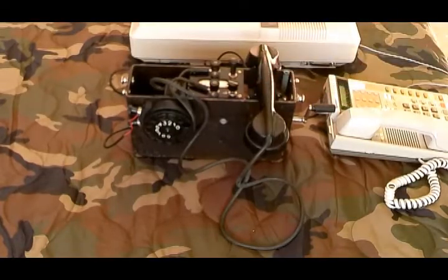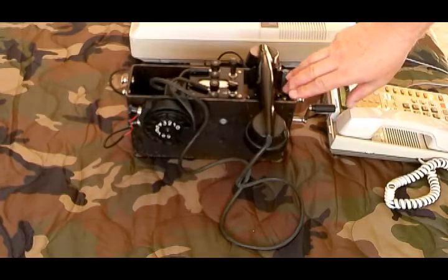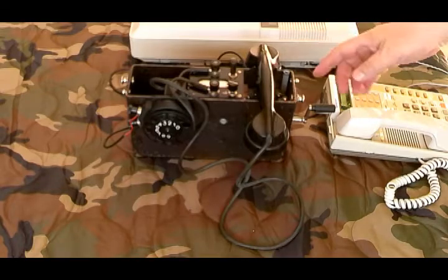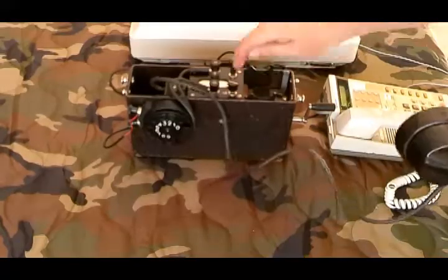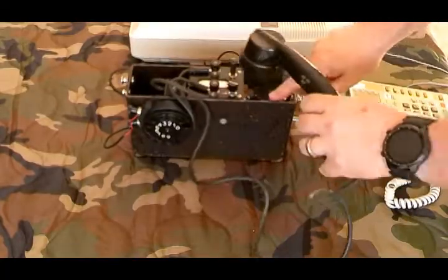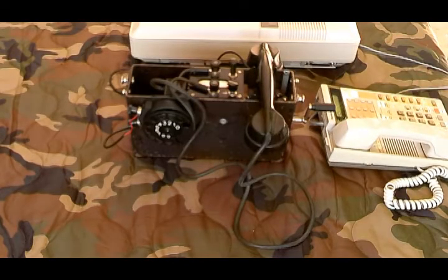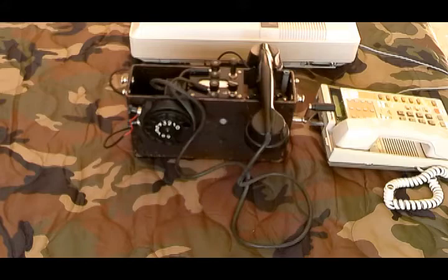It works okay on your home phone lines. You can also operate the phone in common battery mode connected directly point-to-point to another phone. The only issue is that to make a call you use the magneto to send a ring, then take the phone off hook, push the button, and you can call. If the phone isn't hung up on hook, it won't ring with an incoming call from another field phone. This is the Swedish M37 phone in common battery dialing mode with the dialing unit. Thanks for watching.